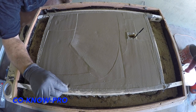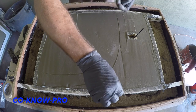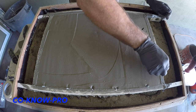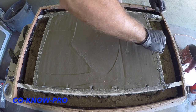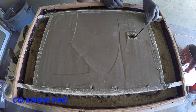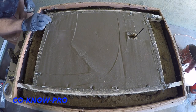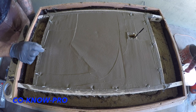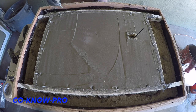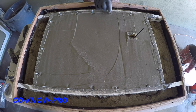Alright everybody, we're getting our J-bolts in. Typically your J-bolts or hold-downs are installed on some hangers which attach to your forms with duplex nails. In this case the concrete's wet, so we're just popping in our J-bolts. These are going to hold down our little exterior plate that we're going to be putting on this little mini house. Typically there'll be a detail on your plans that tells you your spacing for your J-bolts and hold-downs — you have to pay attention to that because it's very important. You typically don't want J-bolts within 10 inches of any splices on your mud-sill plate or from the corners.